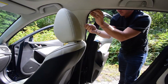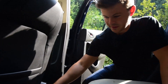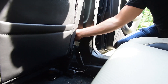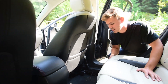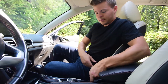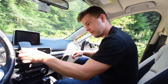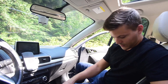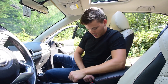Run it all the way around inside the weather stripping so the cable is hidden. Then decide based on how your vehicle is designed — you can come around the side, go up the middle of the seat, or come inside. Once you decide, come to the front. This is your interior antenna — we're just going to attach it to the vent here with these spokes. The last step is plugging in your power source into your cigarette lighter and connecting everything.